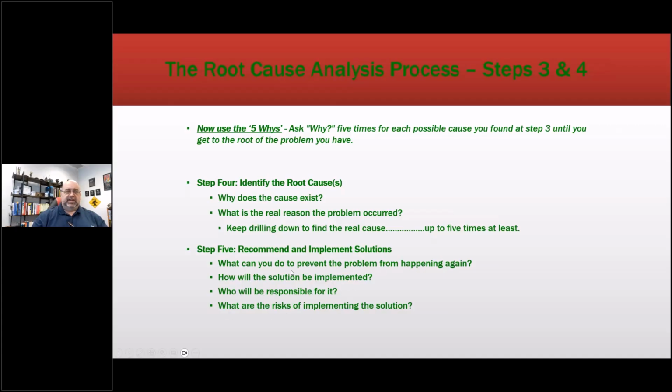Now, this is interesting, and a lesson learned for us as well. Often we'll go out and say, why are all my machines failing that we put on VFDs? Well, where are the filters? What are filters? Well, you need to have filters on these drives. Well, they told us we don't need filters because they're clean drives. You always need filters on drives. So we took a look at the output of the thing. We saw that installation was ignored.